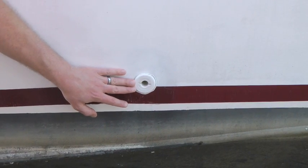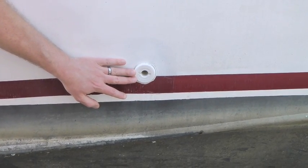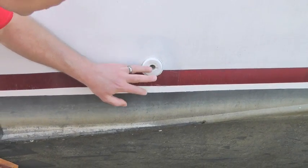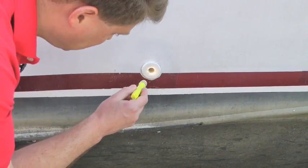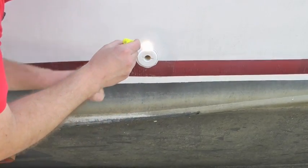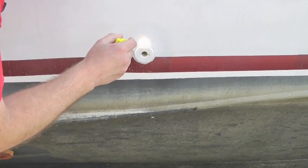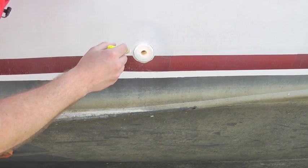So let's get started. Take advantage of the boat being on the hard to check fittings, zincs, and running gear. Plastic fittings near the waterline are a hazard. UV damage can make them crack, and oftentimes they'll crack on the inside where you can't see or reach. Make sure you have a small light and you can look inside and examine for any damage. Plastic fittings such as this should be replaced with bronze or Marelon when you have the opportunity.